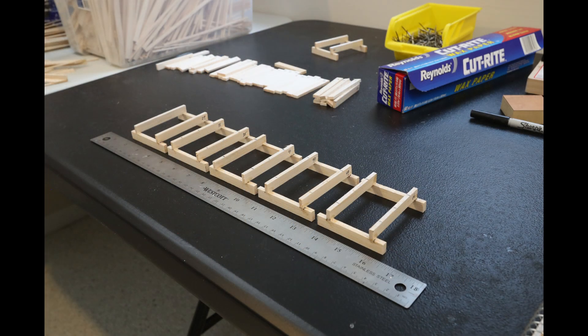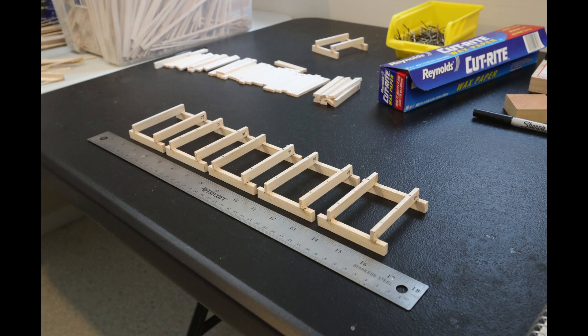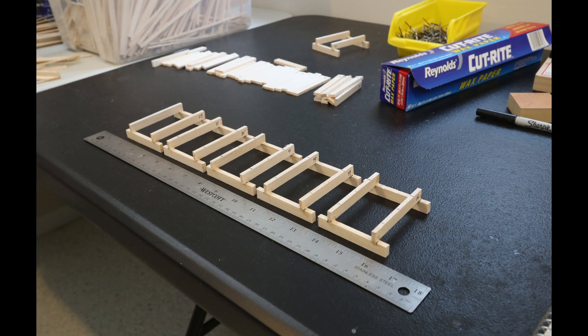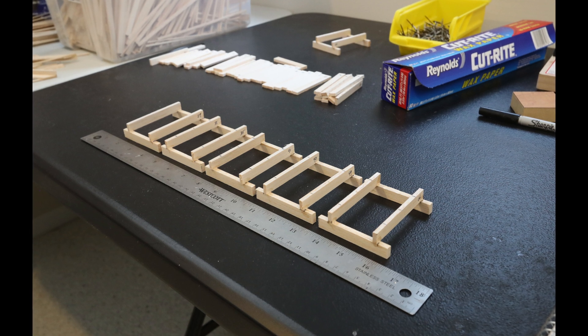I'm a very big fan of keeping things as simple as possible for these types of situations. The more simple the design, the more repeatable and reliable it will be. The most simple design possible would be to use just two cross-support beams to support the loading block. By varying the density of the balsa, it's possible to use the exact same dimensions to study the strength versus mass.